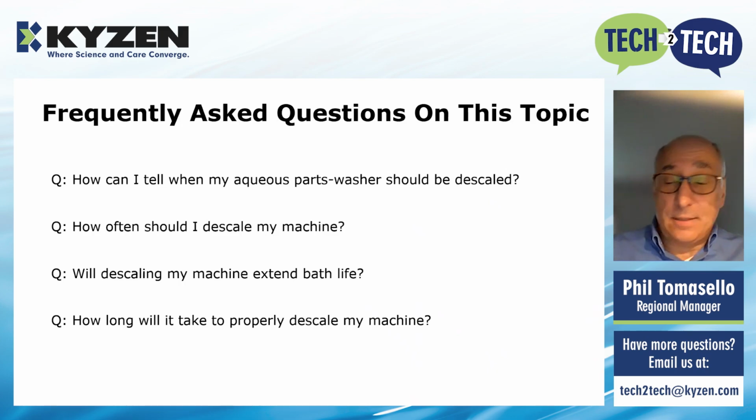Ideally, you should set up a schedule to descale it before you start having parts failures. So depending on many of those variables, very subjective to each manufacturer, take a look at that. Some are doing it quarterly, some more frequently, some less frequently, but it's good to start gathering data and find out when you can do it to avoid getting to the point where you have those failures.